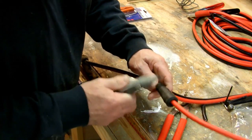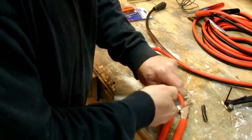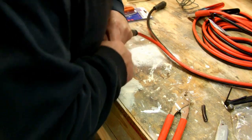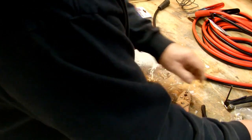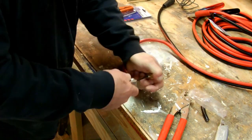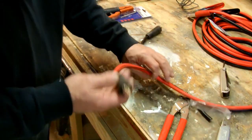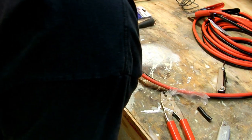Just make sure you put the sleeve on first, or it'll really be a cussing fest. When you're cutting the insulation, don't go too deep. It's not the end of the world, but you'd probably be better off if you didn't cut any of the wires. Just put that on there like that and tighten her down. This isn't rocket science - these connectors have been thrown around and still hold up. Take it against something hard where you can control it and just push your body against it.